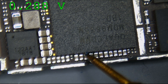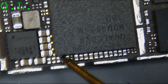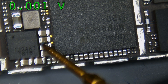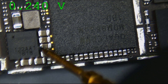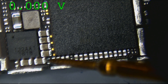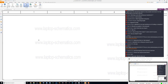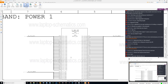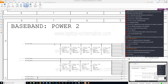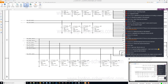Sometimes it's going to beep intermittently, but that's just because of a lower diode mode reading. Beeping doesn't necessarily mean short-circuited — beeping doesn't necessarily mean bad. I'm getting 0.2 here, and things that are next to each other are typically the same. I'm hearing beeping but I'm not getting excited yet. Looking at PP1V0, PP0V9 — I'm guessing we're going to need those. Checking all the power rails right by where things are messed up: PP1V2, PP1V8, PP1V0, PP3V075, PP0V95.